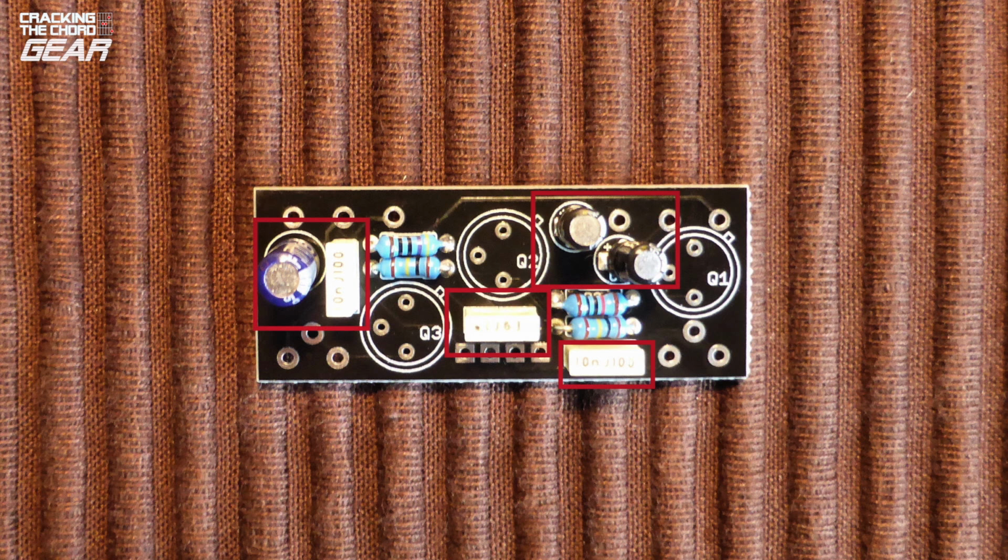The capacitors were more challenging simply because you need to get the right values of capacitor in place the correct way round. I know that the positive lead is always the long lead and that the negative lead is indicated by a stripe on the side of the capacitor, but that doesn't stop me checking just one more time to make absolutely sure. I needed a magnifying glass to check the component values.